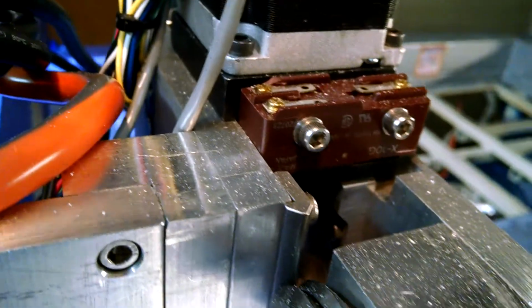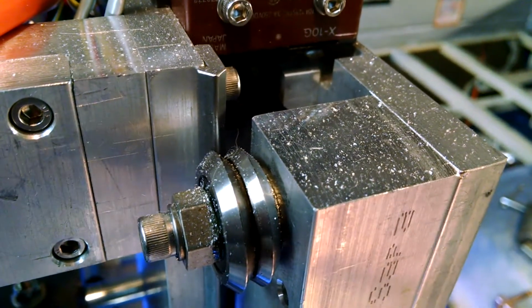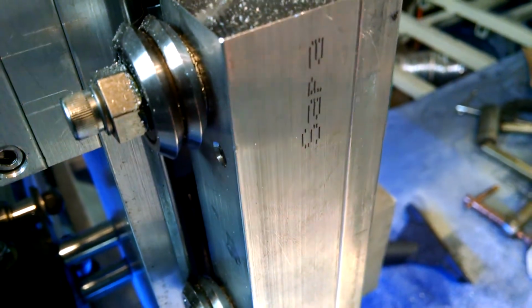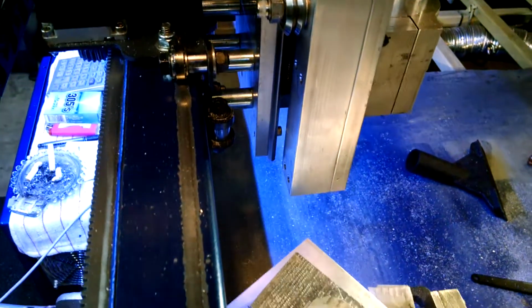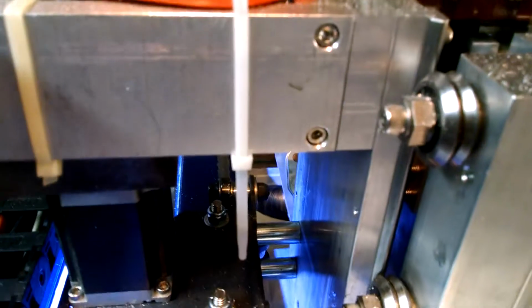I wonder why I got clothespins up there. Yeah, I knew you'd ask. Well, actually, when I was milling this, surfacing it, I clamped these clothespins in some of these cavities to take out some of the vibration, because I was working extremely late at night and it took out a little bit of the higher pitch. It was resonating from the stock itself.